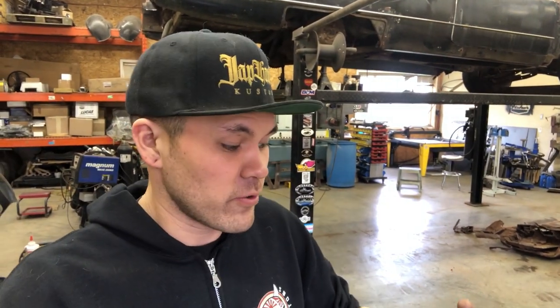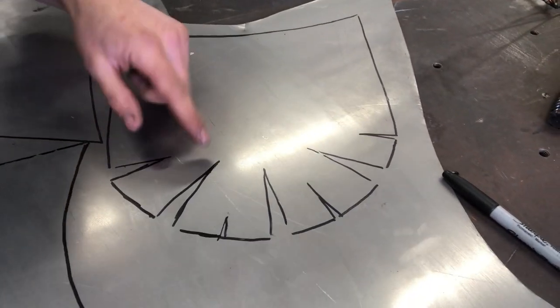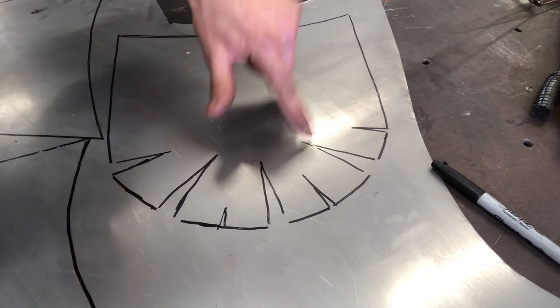Basically, what I'm trying to do here now is I can see where the shrinks go to, like the depth of the shrink. On this one, it'll make more sense. I've got deep ones here. I've got shallow ones here. When I'm trying to make a part that's nice and round, that's very even, I obviously wanna have an even roadmap as to where to shrink. So those two depths are the stack.